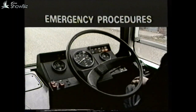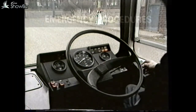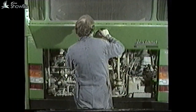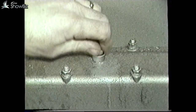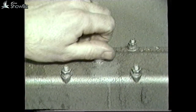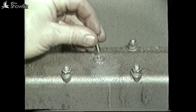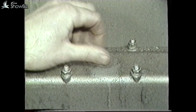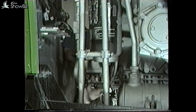If there is complete electrical failure or a fault on the control panel and you're required to move the vehicle, second gear can be engaged manually by removing the small sleeve on the screw on the top of the EH block and replacing the screw fully until it contacts with the second gear solenoid. The operation of this will move the solenoid down and engage second gear. However, before you move the vehicle, disconnect the wiring to the EH block to isolate the change speed control and avoid any possibility of making a two-gear selection.